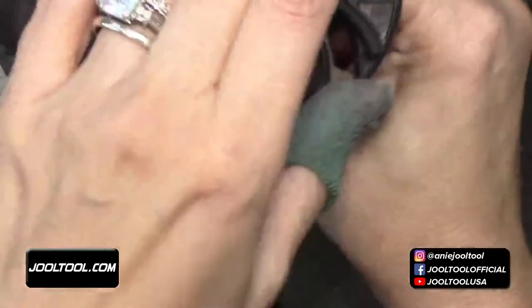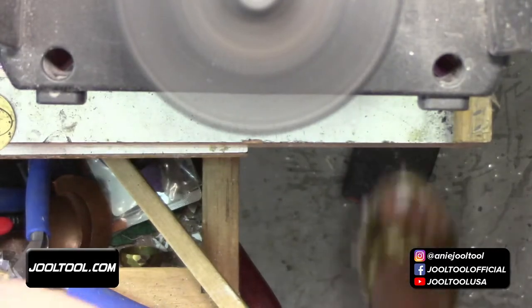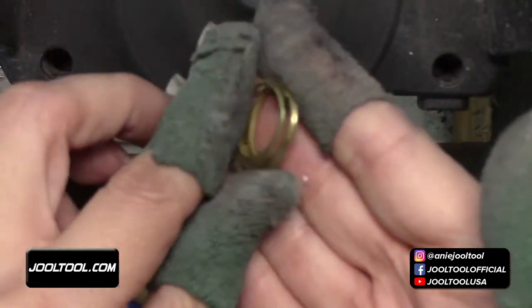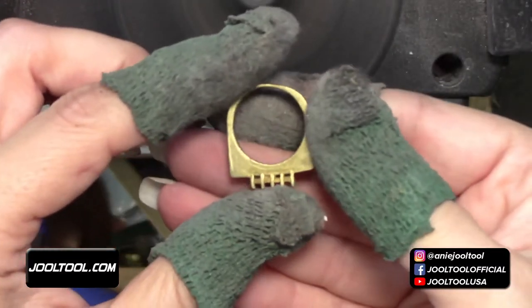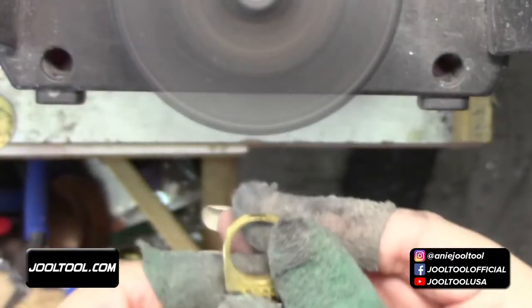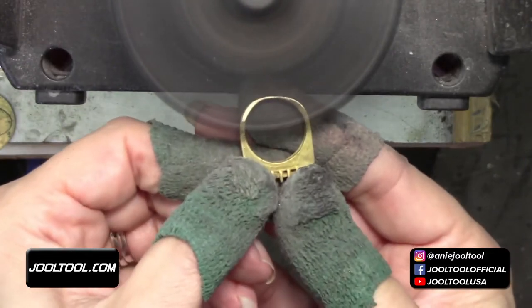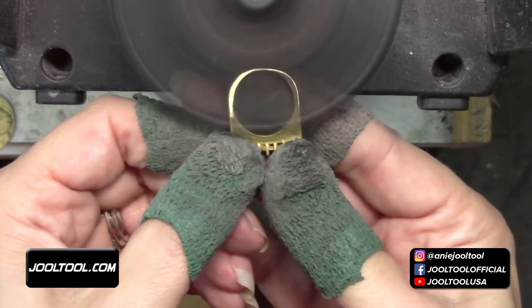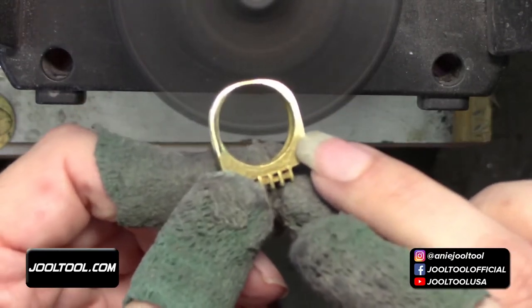So the medium is going to give you crisp flat. Let's say I want something very, very flat. You see how uneven this casting is? This is a raw casting. Okay, so watch how nice and crisp it does it. I'm going to hold it already. I'm not doing anything spectacular. I'm just holding it there. And already we have porosity pop up.